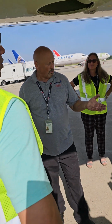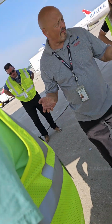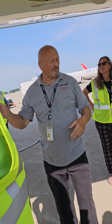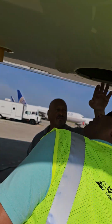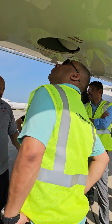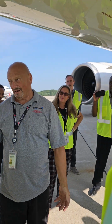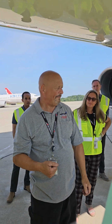On a cold fall day, let's say, where the temperature is 45 degrees or less, this will be closed. It's cool enough that it can just recirculate the air and it's fine. But once the temperature goes above 45, then this opens. When I start both engines, so today with this open, I start both engines, it's going to go closed. I might be in Phoenix and it's 120 degrees, that's going to go closed.